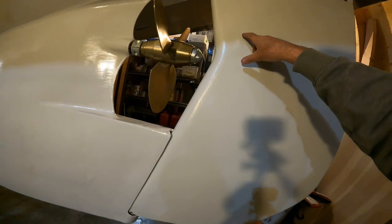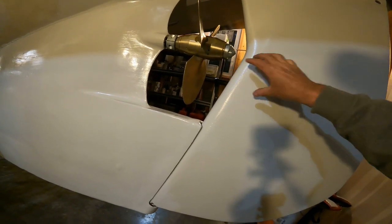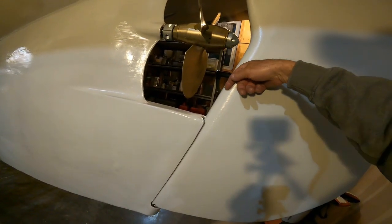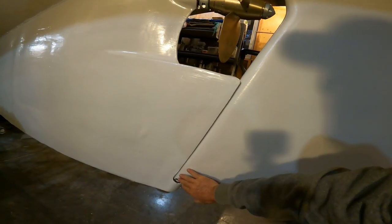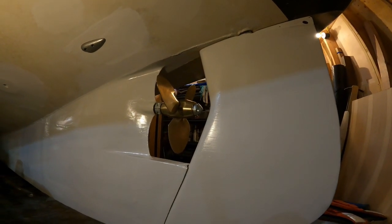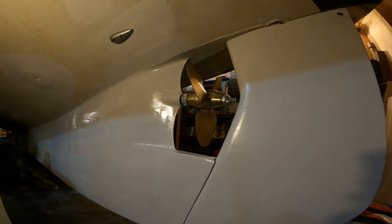From the original build back 50 years ago, the builders had a seam between the rudder shaft and the plate right along the fat portion of the rudder — just the wrong place to have a lump. I went ahead and faired that as well all the way down. I'm looking forward — maybe if I'm lucky I might notice a little bit of improvement in rudder effectiveness, maybe even a tiny bit of motoring efficiency increase as well.